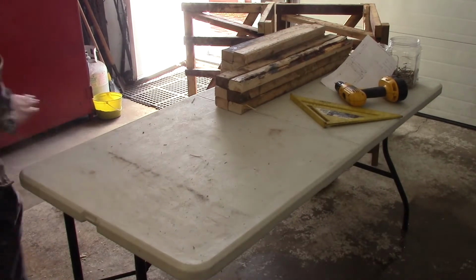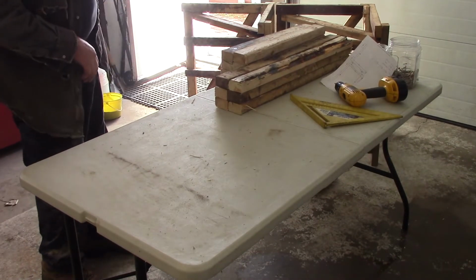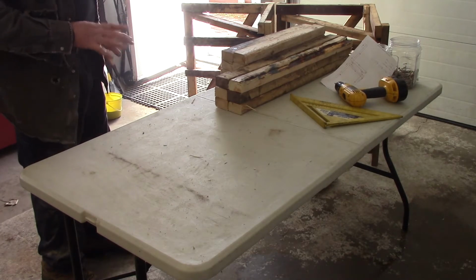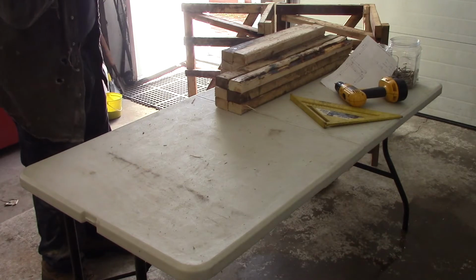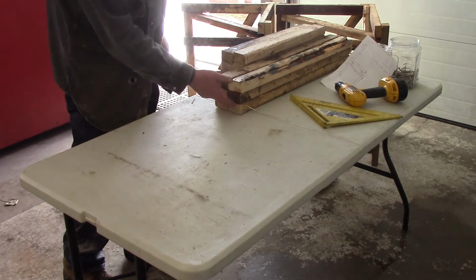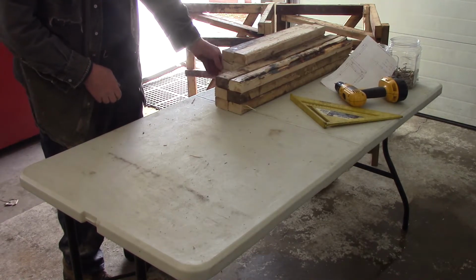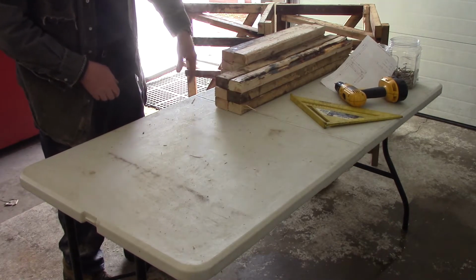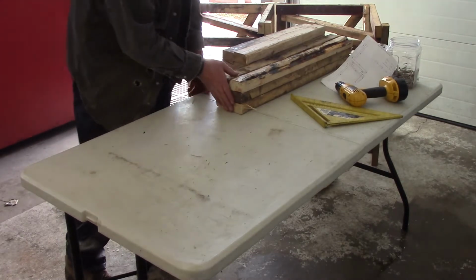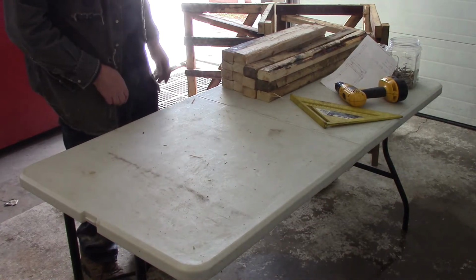Hey guys, I'll just take you through the process of making the corner. And so I've got this utilized to the least amount of wood. That would be 4 lengths, 4 8-footers. So I got 6 32s and 8 23 3/4. I have to go 3/4 because by the time you cut, you take away 1/8 of an inch per cut. But okay, so let's get on to, I'll show you how I make my corners.